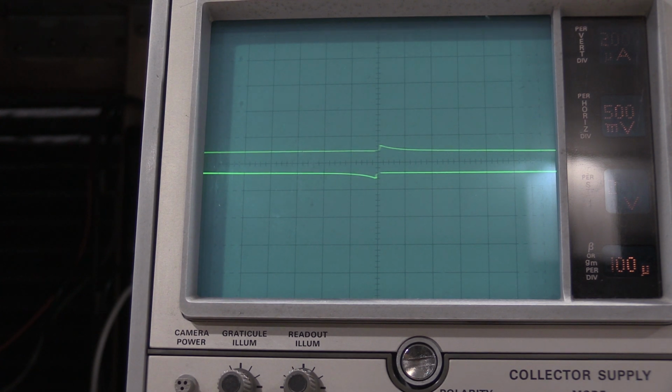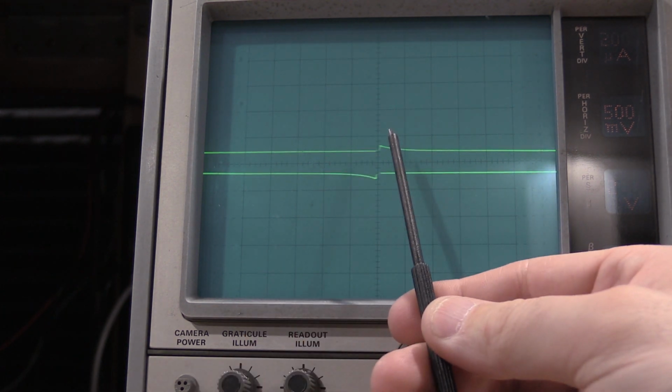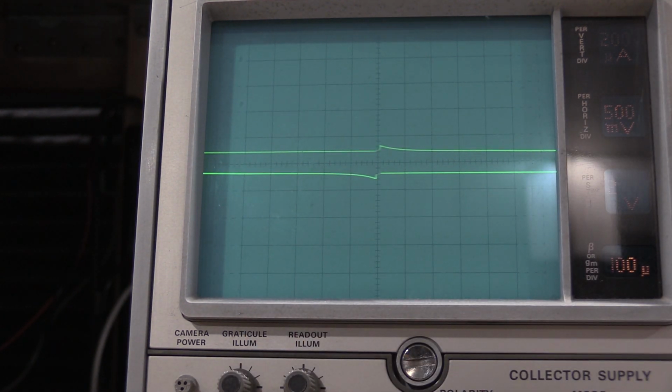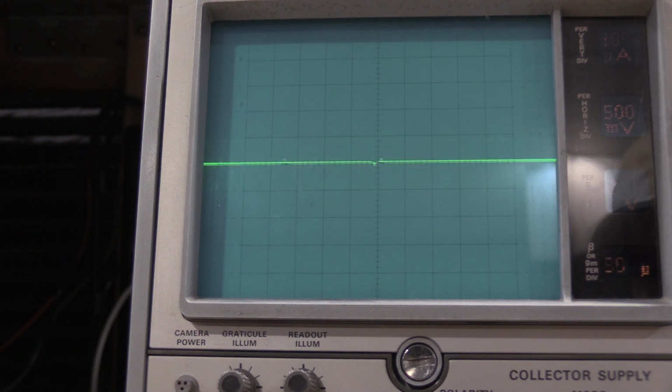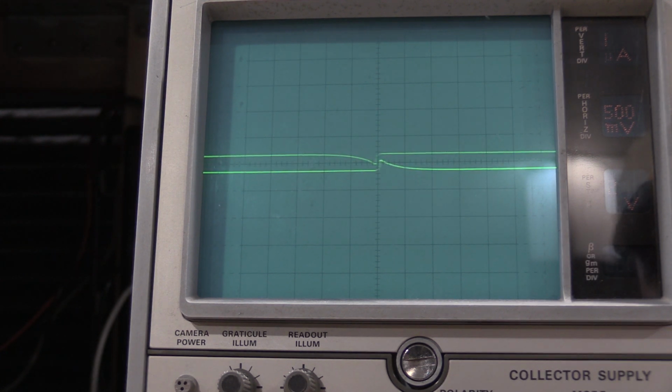Okay, so it did not give me enough vertical spacing to see the 0 cross very well. So the 0 cross adjusts the unit like this. So what it wants is, they want this not to be overlapping like that, but to be close to each other, but not quite overlapping.